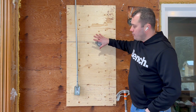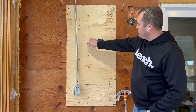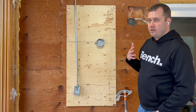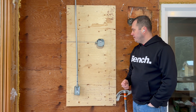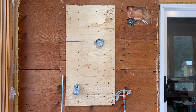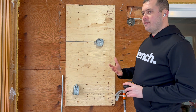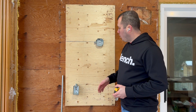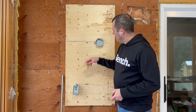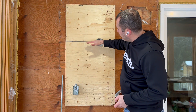If you have a box down here and a box up here, you have to bend that conduit 90 degrees to fit into that box. So the first thing you want to do when bending that 90 degree bend into a second box is figure out where the back of the bend will be. From this point here where the connector was, to the very back edge of this connector — that's your back of bend.